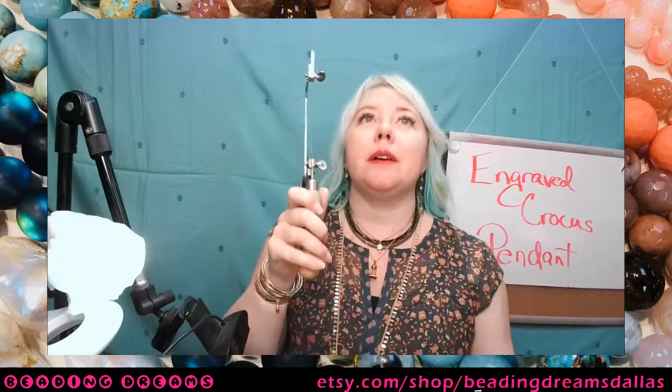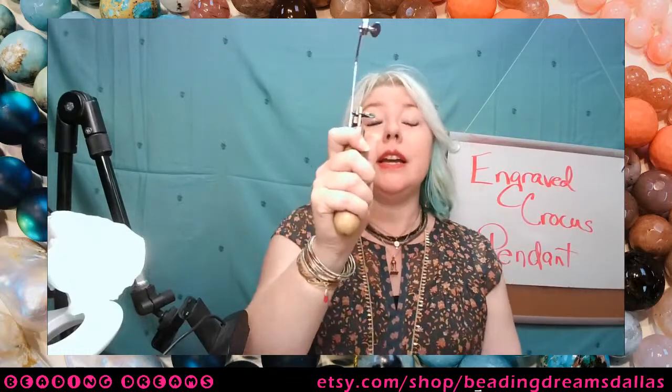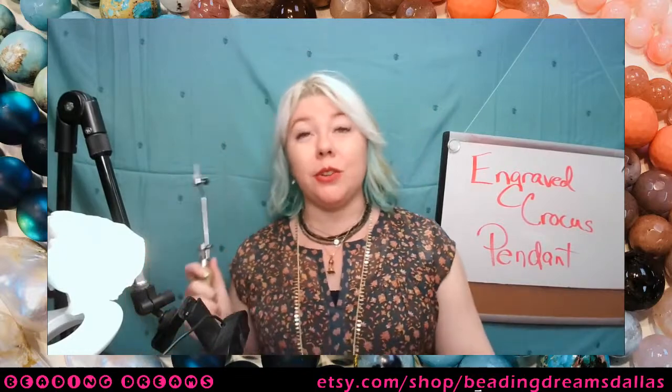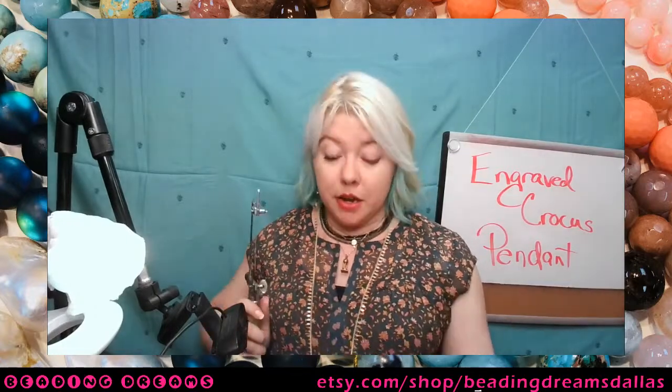Number two, it's helpful to think of your saw frame as only having one dimension of motion, which is up and down, kind of like the needle of a sewing machine. If you think about pushing your saw frame forward, your blade's gonna get bound up in your metal and you're gonna wind up breaking a whole lot of blades. The last thing, and this is really something that beginning sawers tend to do, is you don't want to lead with the head of the saw. You want to keep it vertical. And if you have a tendency to lead with the head of the saw, what helped me when I was a beginner was thinking of leading with actually the handle of the saw. What that did is it compensated for my tendency to lead with the head of the saw and brought everything back to a vertical.